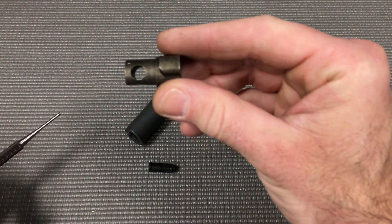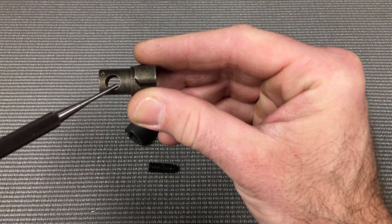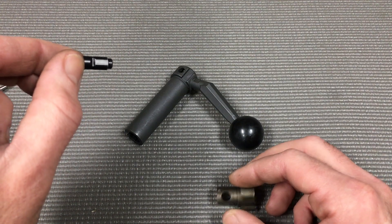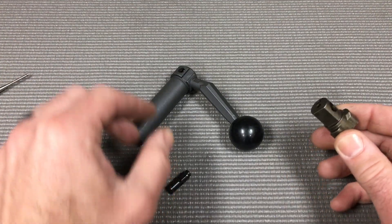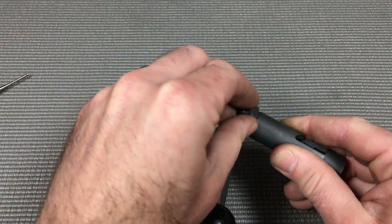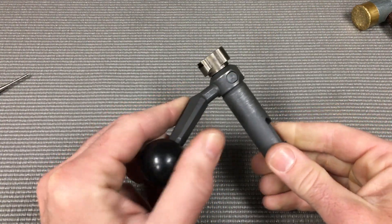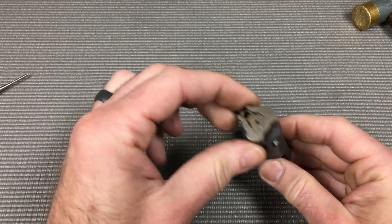The reason is that in our bolt head, the ejector spring actually protrudes into this hole a little bit — and that's a design feature to retain the pin. You can see there are flats machined on both sides of the pin, and there's also a groove on both sides. When you put your bolt head assembly into your bolt and set the pin in, you'll get to about right here and feel some pressure. All you do is grab a mallet and give it a little tap.